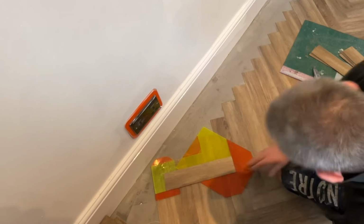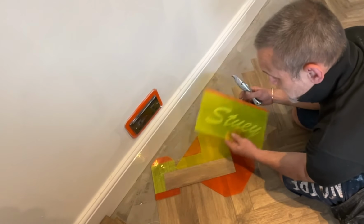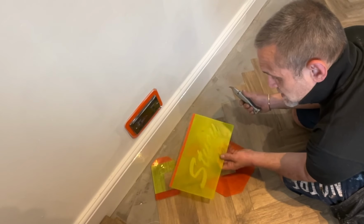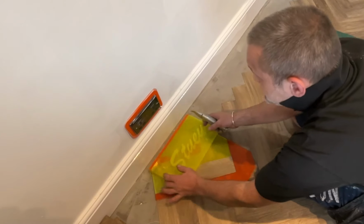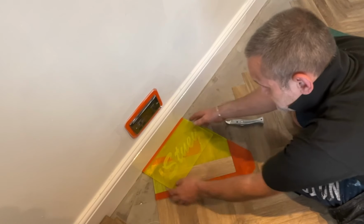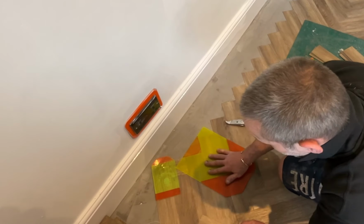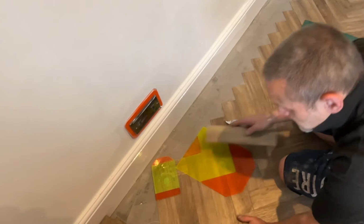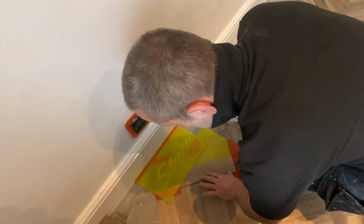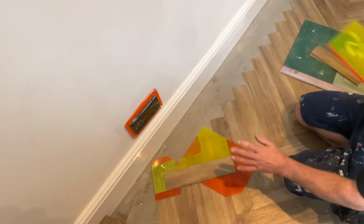So now that's on there. Now, here's the deal with the holly board and other people using them when they're first changing over from what they've previously learned with traditional methods: you're still trying to use it the same way. You're being so delicate putting that on there, but if you're doing that, then you're defeating the object. The idea of the holly boards is for you to achieve these cuts, and the boards will take out the side of it where human error can take place. So with that, I can now get a nice firm cut on that, but I haven't actually roughed it in.